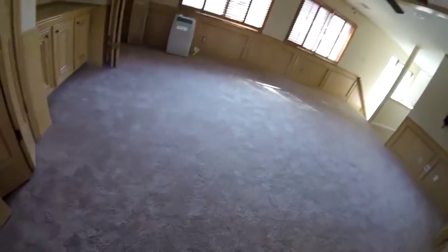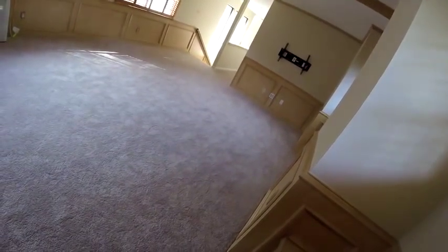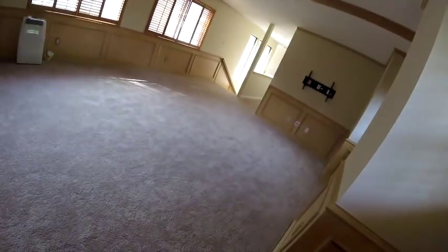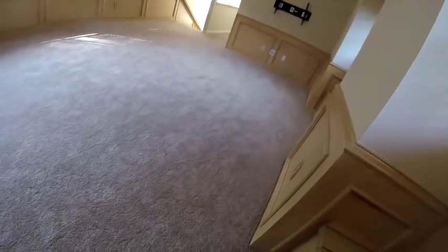I see that you're in need of a maintenance on both units. I want to know, do you want me to take care of that while I'm out here? I charge $75 per unit while I'm on a visit. Well, I don't think he'll want to do the downstairs unit because we're selling the house and we're about to close on it. Did the upstairs unit start working? Yeah, it's running now. Like I say, it had burnt wires to the contactor, and the contactor is rusted out. So I'm going to go ahead and put a new contactor on there, and I already repaired the unit, and it's cooling. But I need to monitor it for a while, just make sure everything is running good.